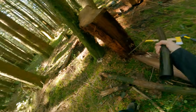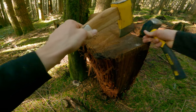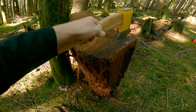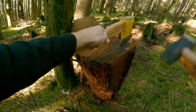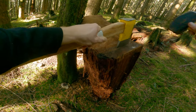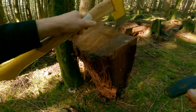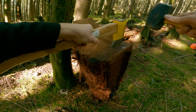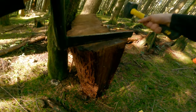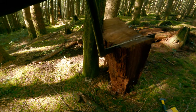There's a bit of rot at the bottom but that's okay — I'll cut that out and there'll be plenty of good use out of this one. This will probably be my first usable slat. I'm going for roughly two inches — you don't need to measure it, just eyeball it, but get a good chunk where it's going to last a long time. A key thing will be to make all the slats the same thickness. Just make the smoothest surface you can.